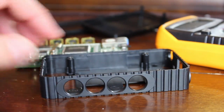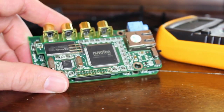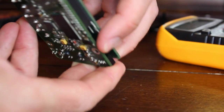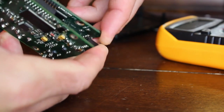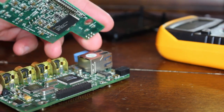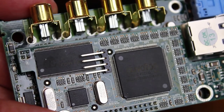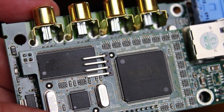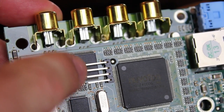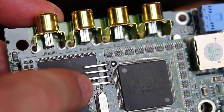The top and bottom unclip, there were three screws, and then you just wiggle the board out. The board itself is actually two boards which can come apart — they connect on a row of pins and then four more pins over there. You have four header pins already on there: ground, receive, transmit, and voltage.